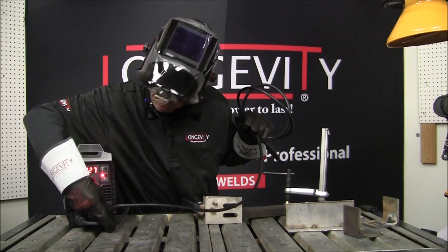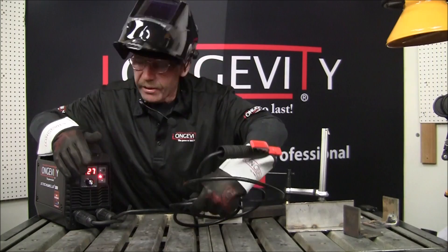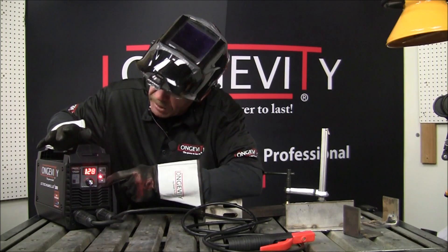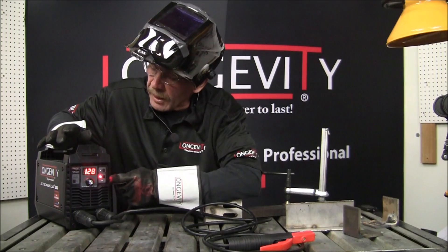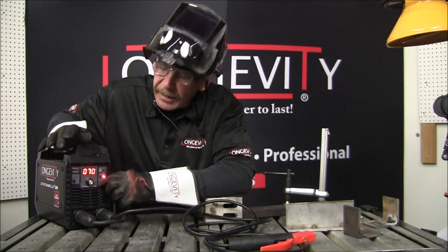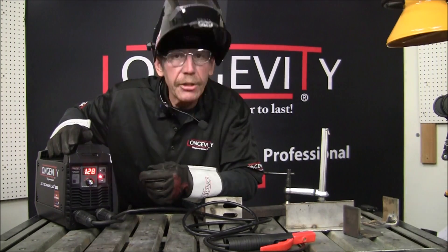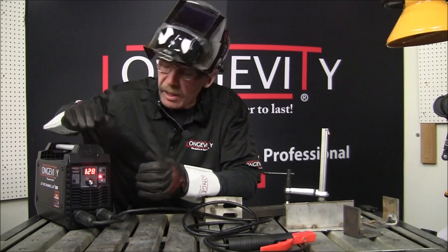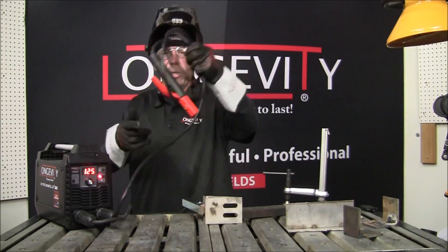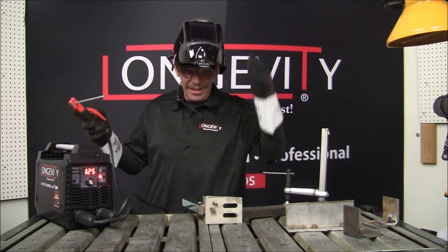This is kind of thick material — quarter-inch stainless — so I'm going to go a little warmer. I had it set at 125, we've got 127 now. Here's your amperage control — it's the only knob you've got to deal with. There's another button where you can set it for arc/stick welding, then push it again and it'll come over to TIG. With TIG welding, remember your polarities — you might have to flip-flop the connections. So we're set on DC, on stick welding, at about 120 to 125. Let's see how this thing works.